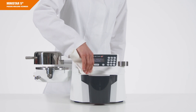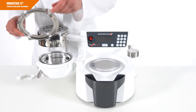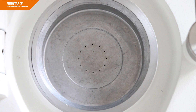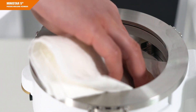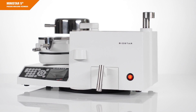Clean the outer surfaces of your MINISTAR-S regularly with a damp cloth and keep it dust free by using the supplied protection cover. Clean the compensation ring regularly and grease it with silicone grease. The model cup and the model platform can be cleaned from time to time using an air nozzle. The reflective surfaces in the pressure chamber ensure optimum heating of the material and should also be kept clean. Our pressure moulding devices are basically maintenance-free, but please check the air hose with filter element regularly for deposits or humidity and replace the filter if necessary.